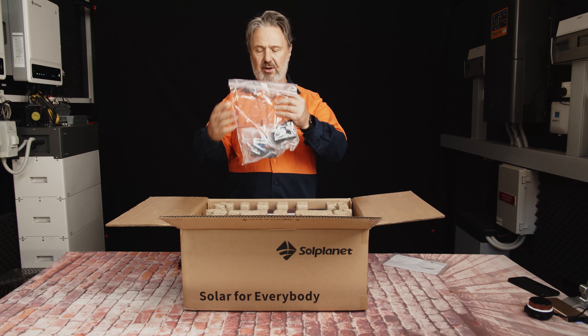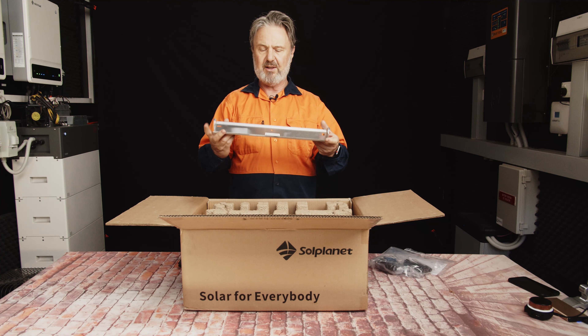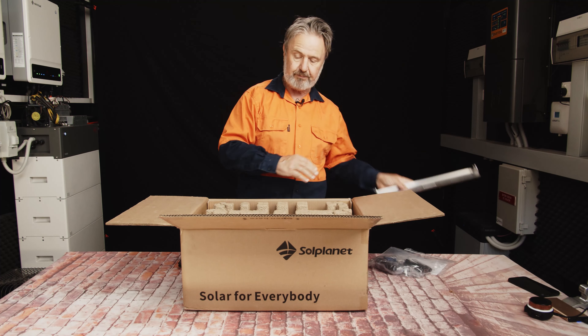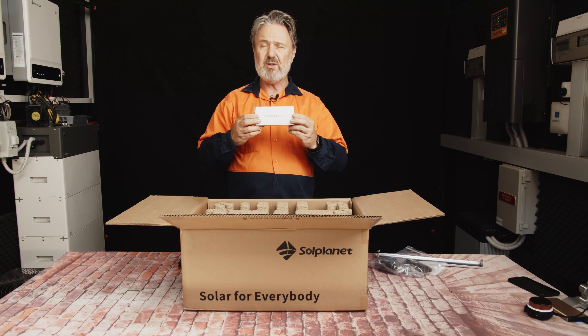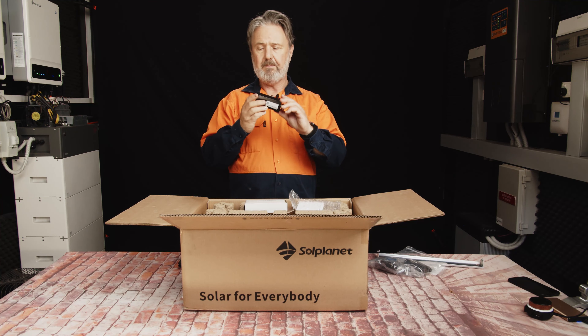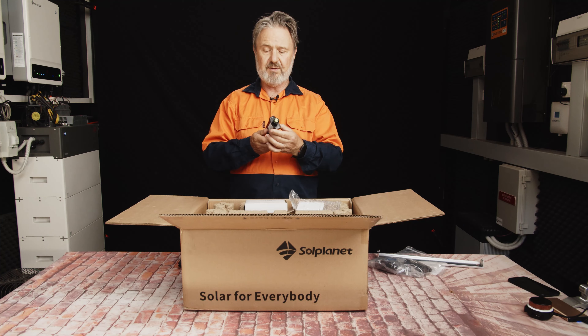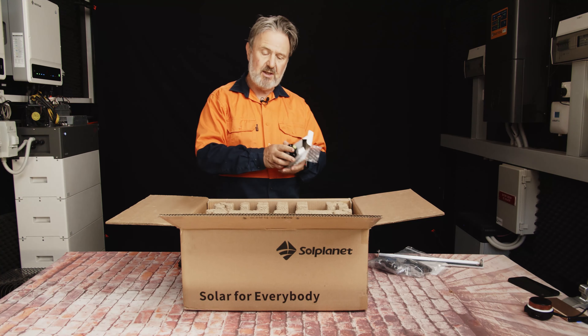The first thing we discover is of course the warranty document and some documentation. We've also got some of the mounting hardware and connection plugs and sockets. That is the mounting strip that goes on the wall — it's pretty lightweight and very compact. Because it's aluminium you can find other locations to drill through it if you wish, but it's got some pre-drilled holes. It's got the ubiquitous WiFi stick. Pretty much most modern grid-tie inverters are connected via WiFi to the customer's LAN — a very convenient way of installing a communication device suitable for the country it's being sold to, so this will be suitable for Australia. It's got a connection port and a locking mechanism so it won't fall off, which is pretty nice. That's the WiFi module — we'll look at that in a bit more detail.